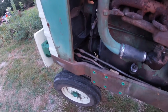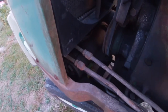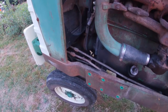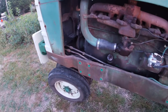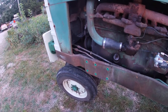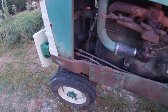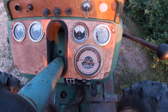The only downside is if you blow a hydraulic line, that's pretty well where you sit — there is no other means to connect the front wheels to the steering motor. I had that happen working on someone else's 1850 that was out in the middle of a field far away from anything. The wheels were turned to one side, but I drove it closer by making a big arc to get it where I needed to work on it. But otherwise there's really no way to steer it without losing a bunch of oil, so you have to fix it where it sits.